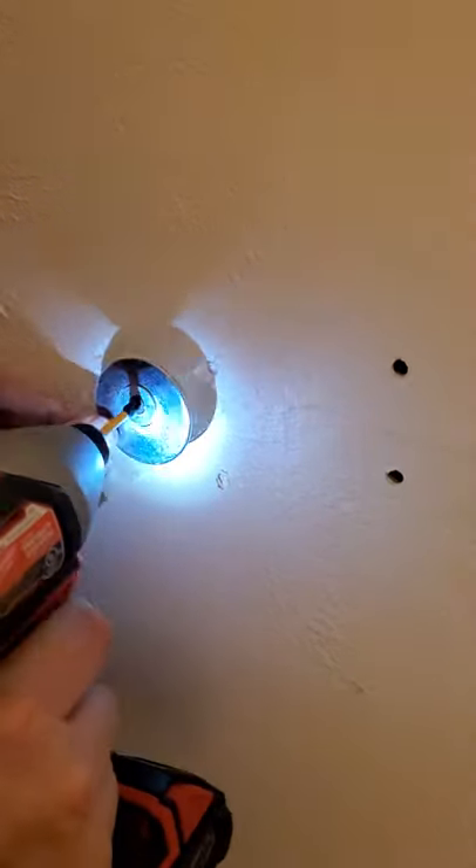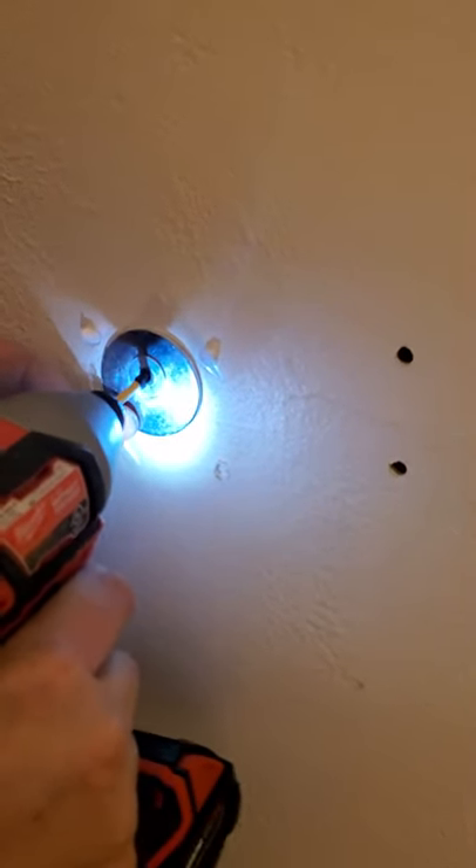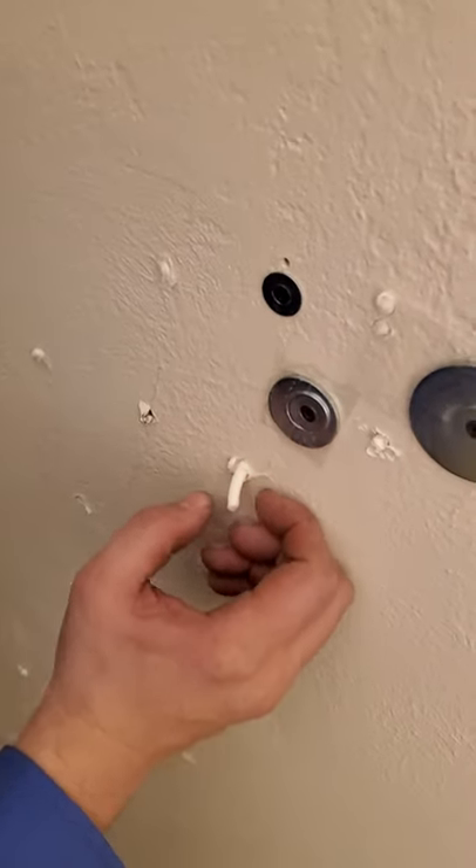So I got to go up a little bit and that's okay. There's a good one. If you look at this guy right here, he's sticking way out because that's how much gap there was for me to fill in. That is how we're going to fix the plaster and save the vintage feel, without spending the god-awful price of the plaster repair kit you can buy online that will do about as much area as I've done so far at about $130. With 12 tubes of glue at 70 holes each — plus some washers and drywall screws — saving a decent amount of money. Hope you do too. Have a nice day.